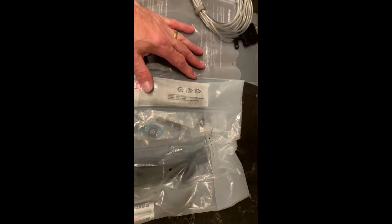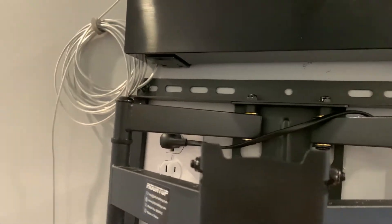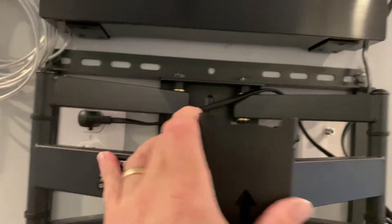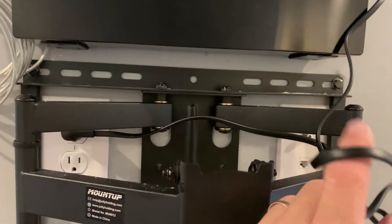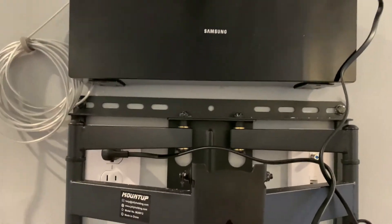There's the power cord — the power cord plugs into the One Connect — and the remote control. I've got to go ahead and plug my wires in because it's easier to reach behind the TV now. I made sure I pulled my power cord through the middle of the mount and back up, so I'll zip-tie that out of the way. When the mount gets pushed back against the wall, it doesn't cut off the cables. If you run those wrong — like over the top — you might pinch it in there, so make sure you find a good routing for your wire.